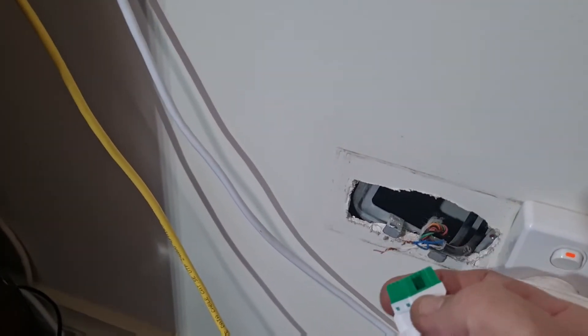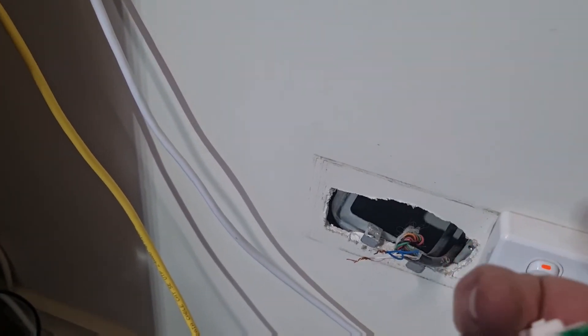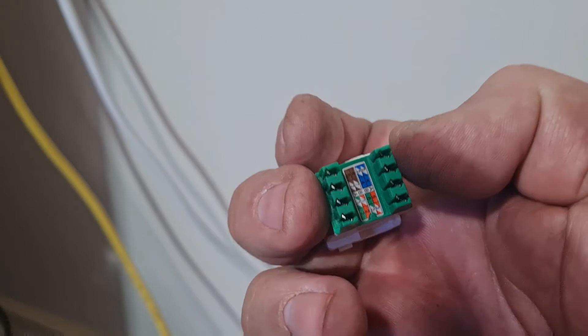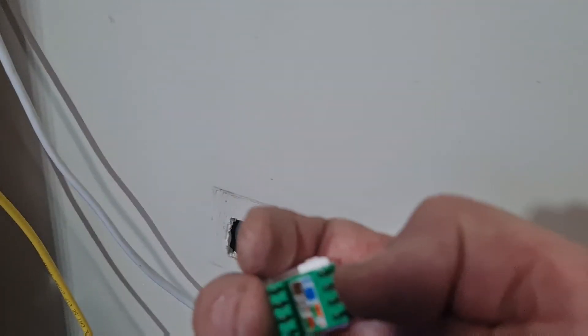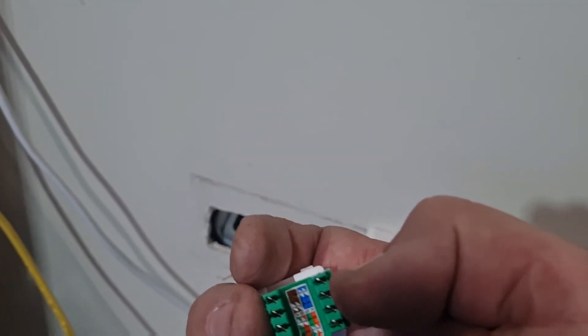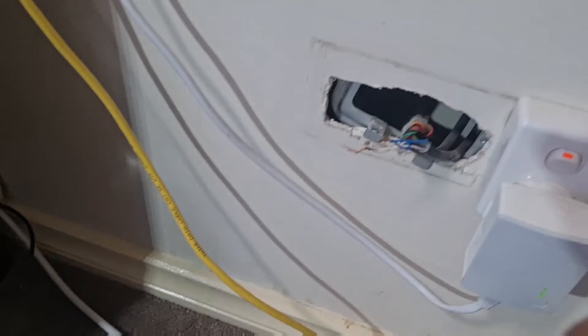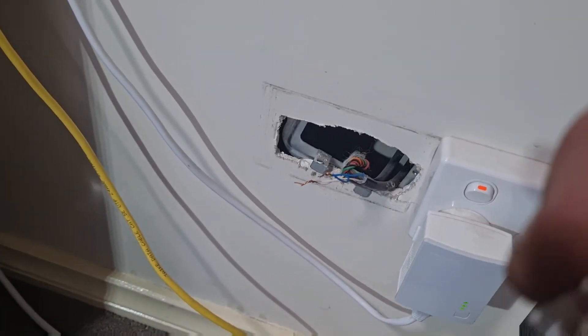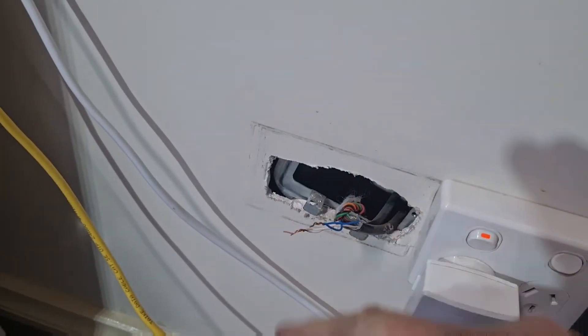What we do is we put these two wires in the positions of the N1. In our case, the N1 is white and blue, and the other one is just blue. Then we have to get a push down tool and push down the wires so they're firmly in position. Then we put a plastic cover on the back to protect the wires, and we might have to snip them off a little bit with our side cutters. Then we'll put them into a wall plate.